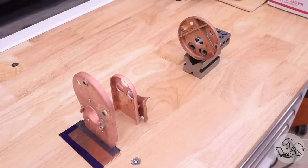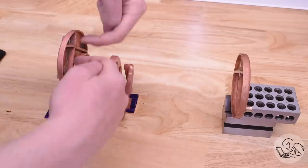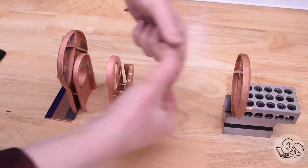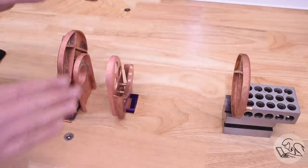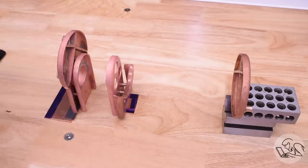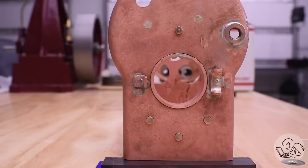Here's a mock-up of how all the sheets, or bulkheads if you like, fit together roughly with standard metric decky for scale. The firebox crown sheet will enclose the firebox there, and then the barrel will of course go right there, joining the throat plate to the front tube sheet, and then the back head is joined to the barrel with an outer sheet. And then here's the fireman's view, if you like, straight down the fire hole there. Someday I look forward to having this view.